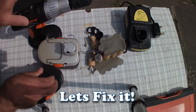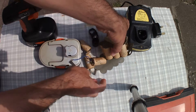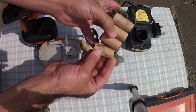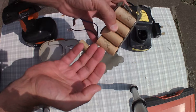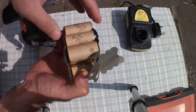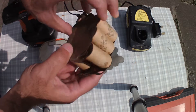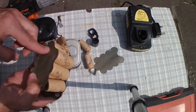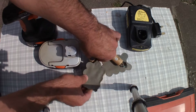The batteries I took out of this casing are like this — each one is 1.2 volts. This particular one is 1,300 milliamp-hours. In this particular pack you have one, two, three, four, five, six, seven, and there are another three in the middle — that's 10 — plus these two, that's 12. Twelve times 1.2 equals 14.4 volts.